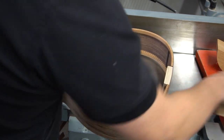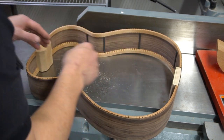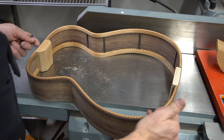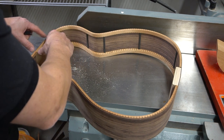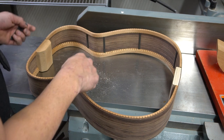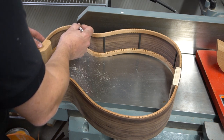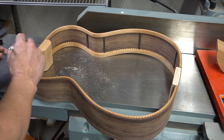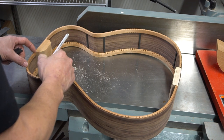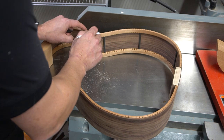One way to set up the other side identically is to use a cloth measuring tape, or try geometry from point to point. But really one of the easiest ways is to just count the number of kerfing curves. If we start at the top at the heel block — where we started our kerfing — we should end up almost identical on both sides. So I count: one, two, three... up to the twenty-seventh one, and then eleven more on the next strut.